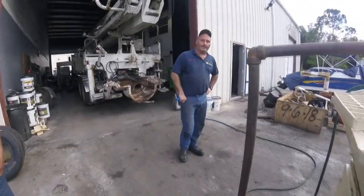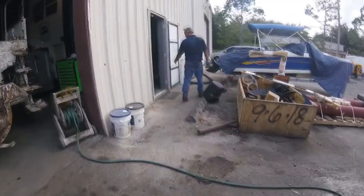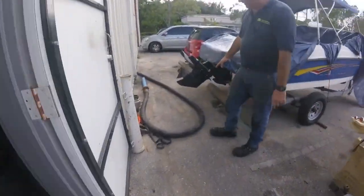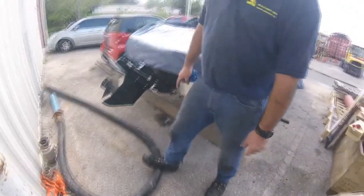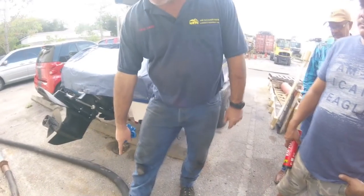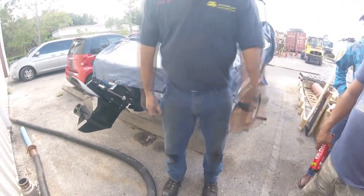And just like when you were pumping, if you're priming out, usually you're going to plug on the prime out. But you feel where it gets hard, soft. You put the machine in reverse, you know where the plug is right here. Move it back a few times, shake it out, put it back together, put it forward, let's go.